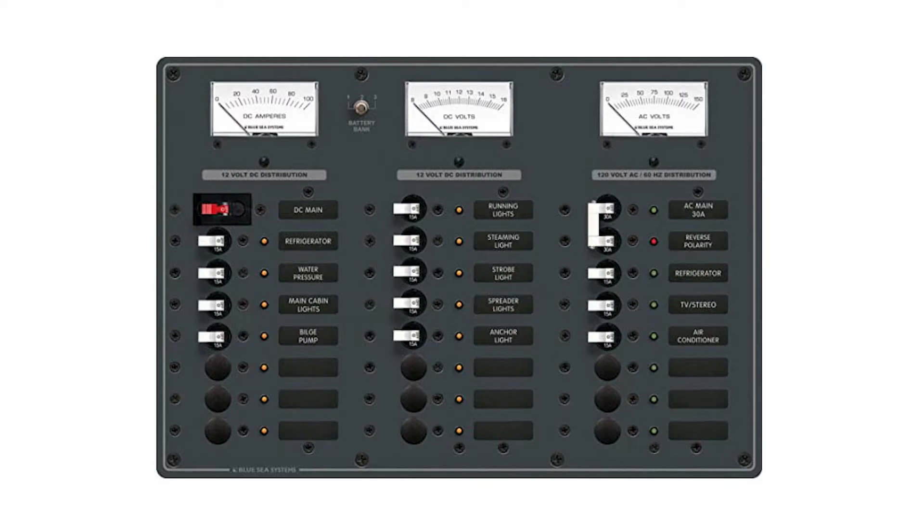When replacing your DC panel, always make sure all circuits have circuit protection. A convenient way to do that is with a toggle circuit breaker that lets you turn the circuit on or off and is rated at the max amperage your wiring and appliance can handle. Circuit breakers come in 5, 10, 15, and 20 amps. If a load needs a 7-amp fuse, put a 7-amp fuse near the appliance, and make sure the wire — rated for 10 or 15 amps — has a matching circuit breaker at the start of the circuit.